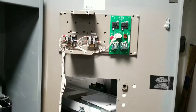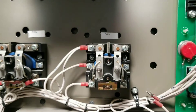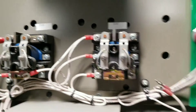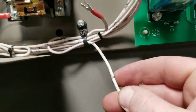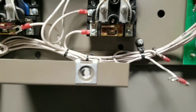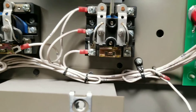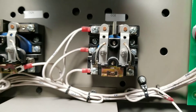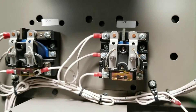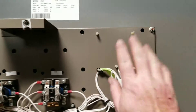In a second I'll be making up this wiring. Okay, here's what I'm talking about: jumper 33 goes over here. We're going to disconnect that jumper, take it out. The lead going back here — this jumper going over here — we're going to cut it out completely and get rid of it; it's not used.